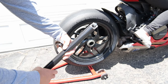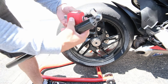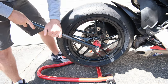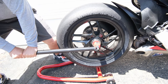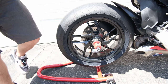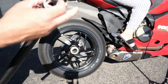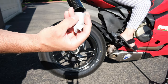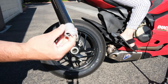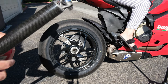Now we're going to try the titanium version and see if it can get up to 100 foot-pounds. The last attempt broke because I didn't epoxy it like I did with this one. I put some painter's tape on it to take up the thickness for the bond line — when you epoxy this in you need a certain thickness for the epoxy to adhere. That stress concentration caused it to bust up the carbon fiber pretty good. This is our third and final attempt.